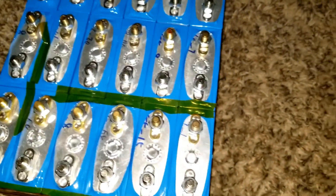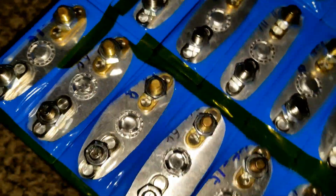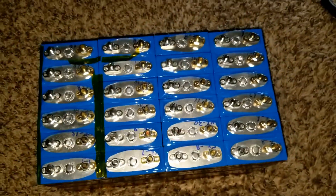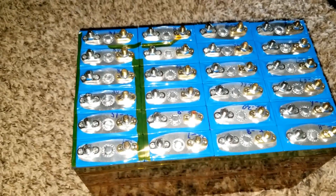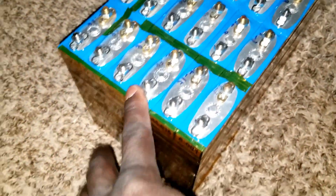If you mount the batteries the way they are right now, you're going to have problems because the battery is about to expand a little bit due to charging and discharging. You have to have some gaps — if you see right in the middle right there, the battery is supposed to have space. I set up this battery in a parallel mode so I can balance them. This is a quick tip on how to prevent swollen batteries.